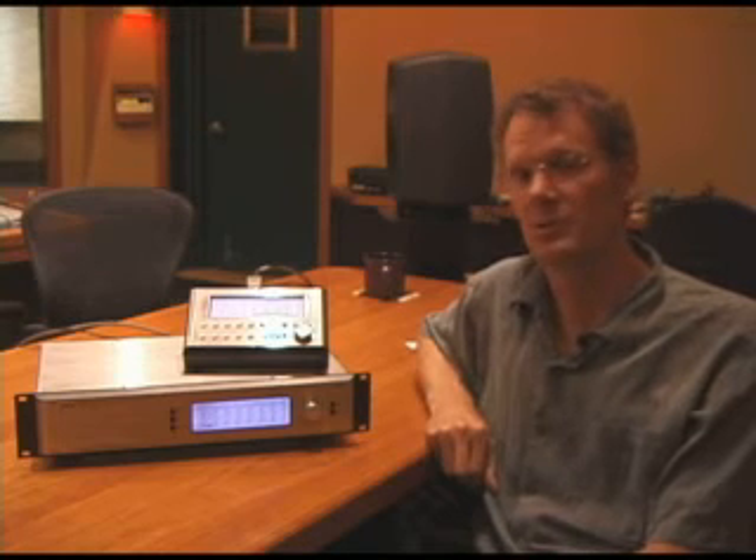Also very important in a remote-control preamp is the output driver stage, since typically the preamp is driving long cable lines back to the studio or to the control room in a truck. The output drivers have to be able to deliver incredible amounts of current to charge the cable capacitance of long lines. The output drivers in the M802 have almost three times the current capability of most microphone preamp outputs, enabling it to drive long lines and multiple lines if you need to send signals to multiple destinations. This, coupled with being able to control it from up to a thousand feet away, makes it an absolutely indispensable tool. We feel that the M802 is an absolutely unique product in the world — nowhere do you get the same level of sonic performance with the flexibility of the remote control capability of this preamplifier. Thanks to our friends at Immersive Studios for letting us use this beautiful facility for this video, and thanks for watching.